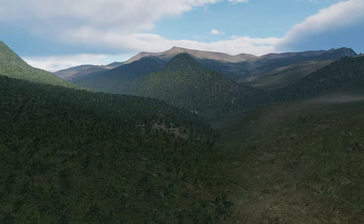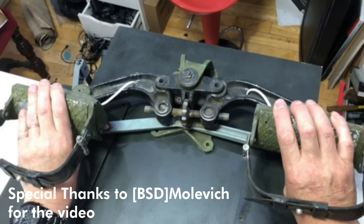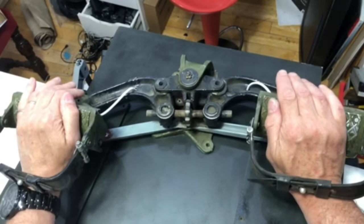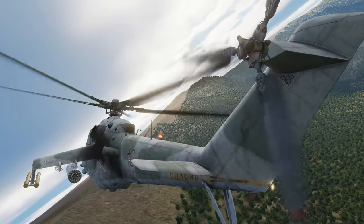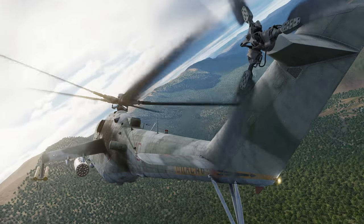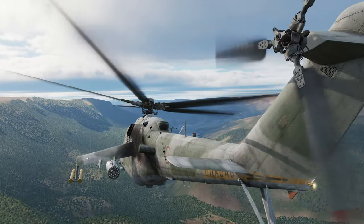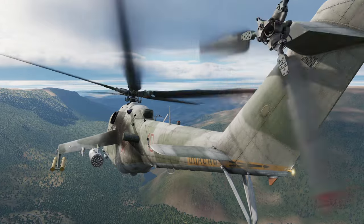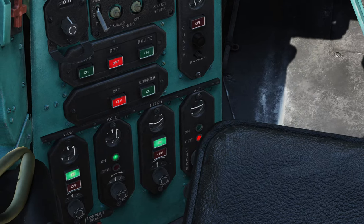Let's check out the micro switch in action on real Mi-24 anti-torque pedals. As you can see, the micro switch is engaged with very minor movements. The pilots can engage the micro switch without moving the pedals, but the pedals cannot be moved without engaging the micro switch. Additionally, the Hind's anti-torque pedals are connected to a dampener system, the SDV-5000, which is there to protect the tail rotor transmission driveshaft from overload. There is also a dampener for the yaw autopilot that is always on if you have the yaw channel on, and the micro switch does not affect that dampening system.